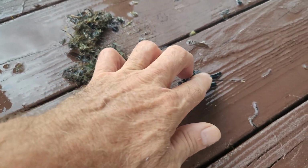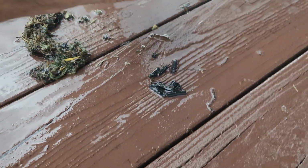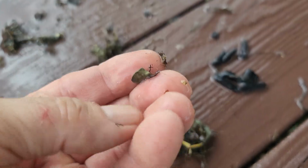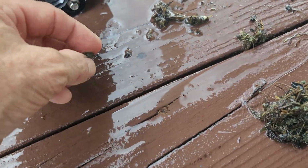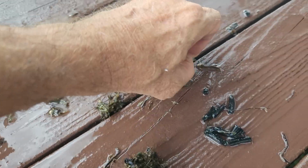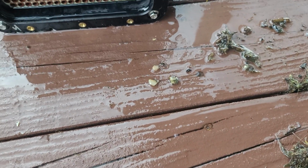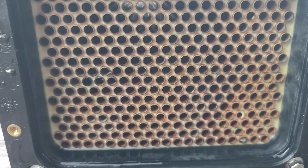So in addition to a lot of the rubber, the fins from the water pump, and all of this debris, there were some actual rocks lodged in there. So somebody has run this aground a few times, whether it be on purpose at a sandbar or by accident, maybe going through something shallow with a rocky bottom. But anyways, those are nicely cleaned out.